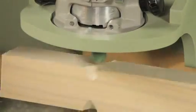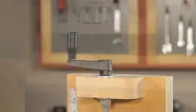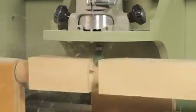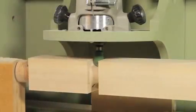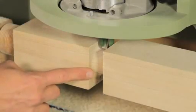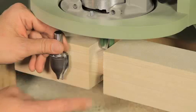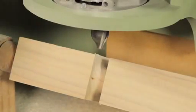To get the best results, I'll make shallow cuts. A single turn of the crank is just about right. You'll continue this process making progressively deeper cuts until you reach the final depth of the cove. After completing the cove cut, I'm going to create more detail by installing a vertical panel raising bit. I'll use it to cut a shoulder on each side of the cove.